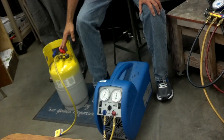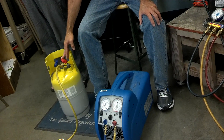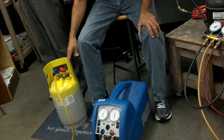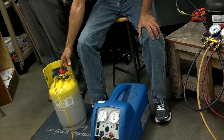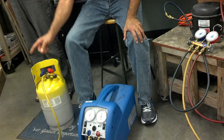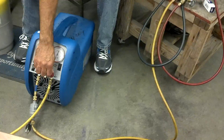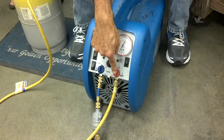Open this up first — the whole reason is so that if there's any leak on the hose you'll know right away and can close it, because your cylinder is always going to have refrigerant in it. Once you open this up, you follow the port right here and make sure this line is also open — the high side. Open this side up here — that's the high side.